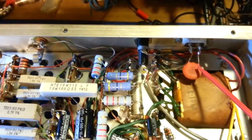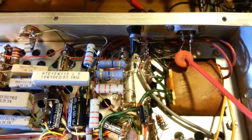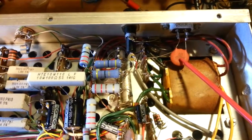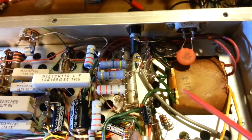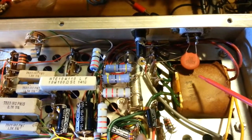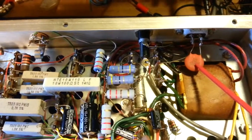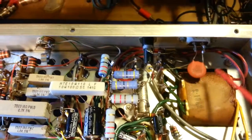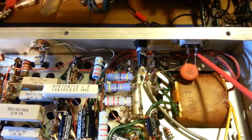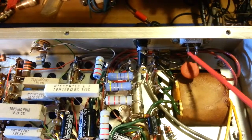And like I say, I have seen these completely burn out, blown into pieces before, because this is probably the hardest working component inside this radio. Even when the radio is turned off, it could be plugged in for 5 years and you never turn it on. This capacitor has been active for those 5 years because you have to remember, it's always connected to the power. As long as this radio is plugged in, this capacitor is always in circuit.